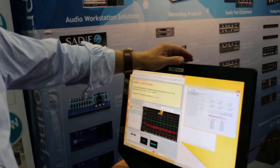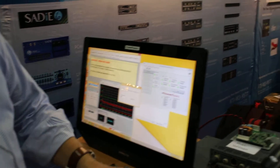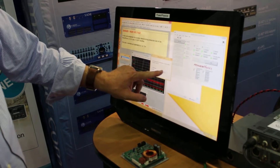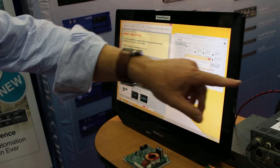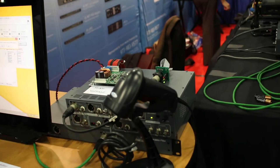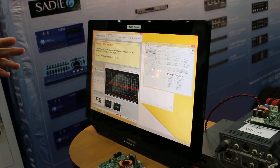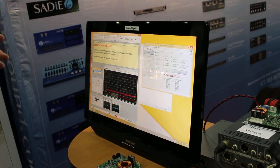It's a production test — it's going to run quickly. We're going to start it, it's going to get a serial number, and we're going to say go. It's powered up the system, the power-on self-test LEDs are good, we tell it to go. Now it's running through a series of events, measuring power at different voltages and calculating gain.